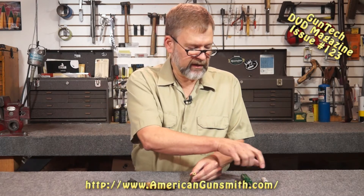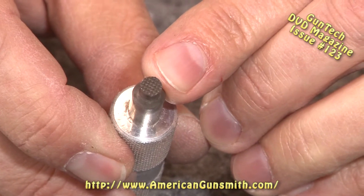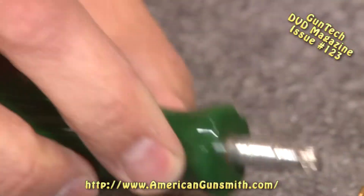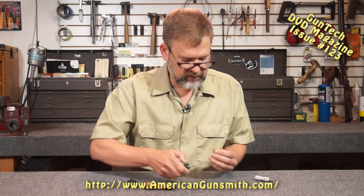You should be able to see a nice shiny line there where it cleaned up the corners. It may not clean up the entire bottom of the primer pocket. We have other tools capable of doing that — scrapers that have a rough end on them, and tools that have wire bristles. They'll get in there and get that carbon so that we don't have a bunch of residue in the bottom of the hole.